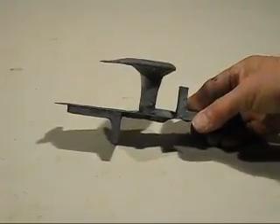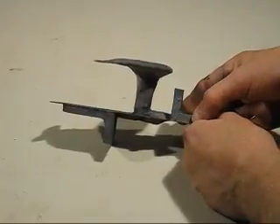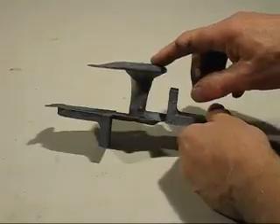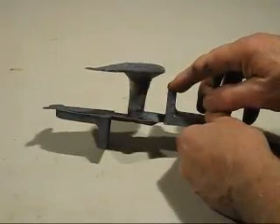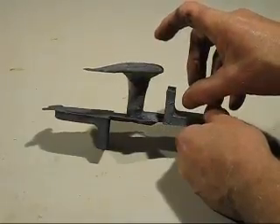On my last video called Crucible Camera, there were two interesting comments made by viewers. The first one was: this gating arrangement worked alright for cast iron, but it probably won't work for aluminium — it'll need a riser on it.